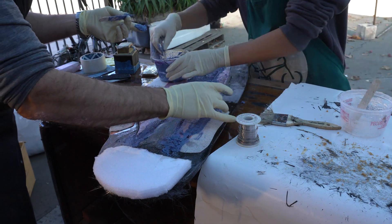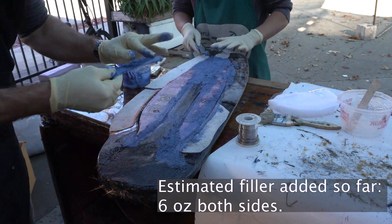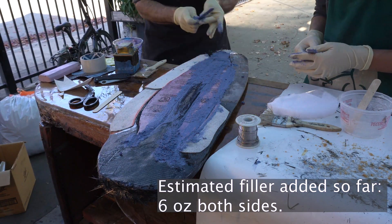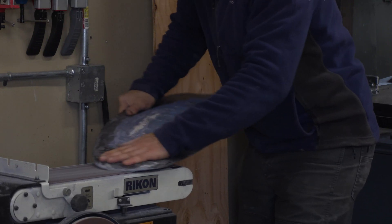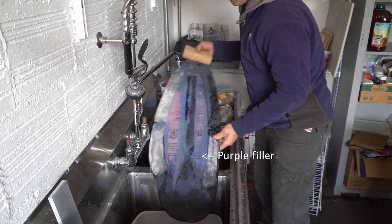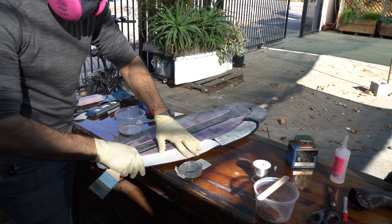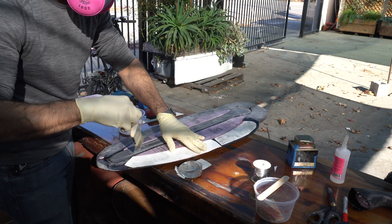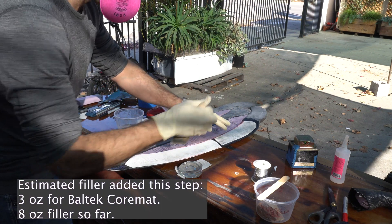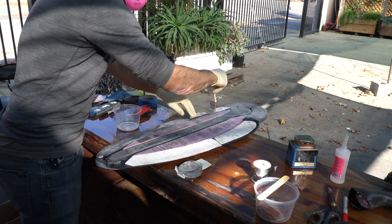I'll estimate how much filler material we were using. I think that tub contained probably three ounces when we started smearing it into the cracks. So we're adding three ounces of purple stuff to one side to fill all the gaps. Now you can see there's the black carbon, the purple filler layer, and then there's these cream-colored strips called Baltec. Baltec is a lightweight filler that comes on a roll — you wet it out with epoxy, it doesn't absorb much epoxy, and it cures rigidly. It's somewhat sandable, although it's not as good as thickened epoxy with micro balloons.